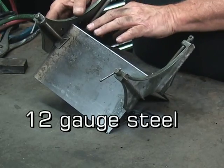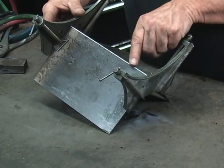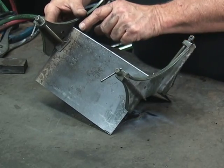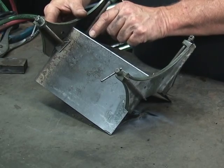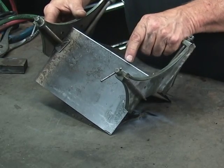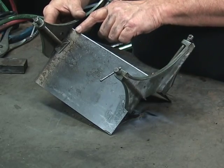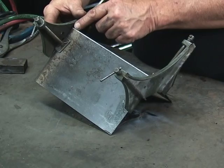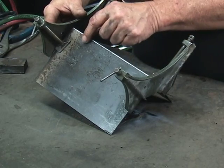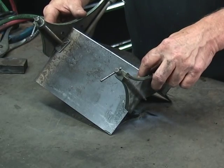You can see what I have here. I've got these clamped together so that the edges are fitting flush together. What I'm going to do is fuse weld, or just melt in several places, which is called a tack weld, so this does not separate on me. When I'm coming down through here with the torch, the heat doesn't expand any place — it doesn't allow this to expand.